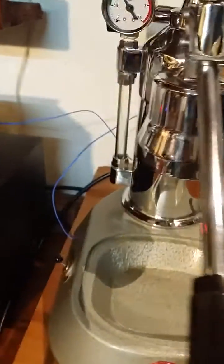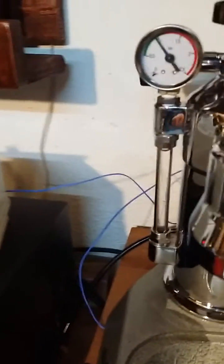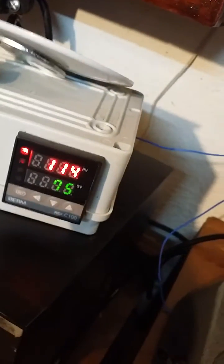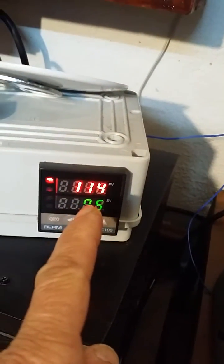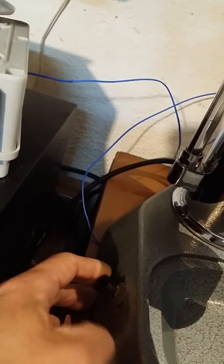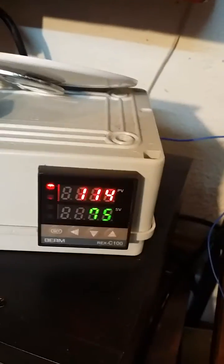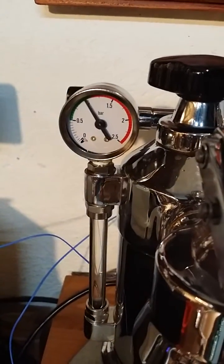Here's a dual element heating at low power for about nine minutes. I'm at 0.9 amps and the temperature at the heating element mounting base is 114°C. This will not be our reference — our reference will be the high power setting.